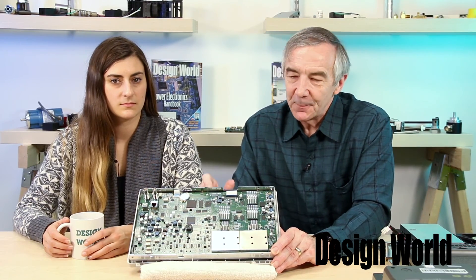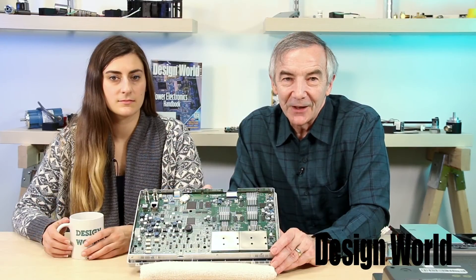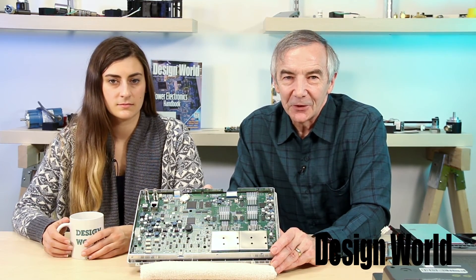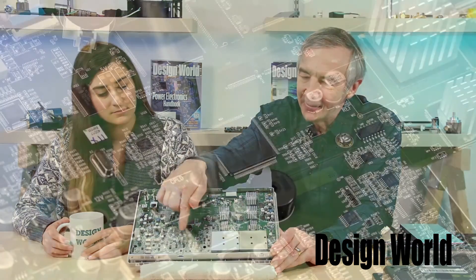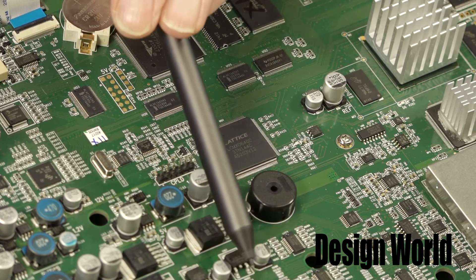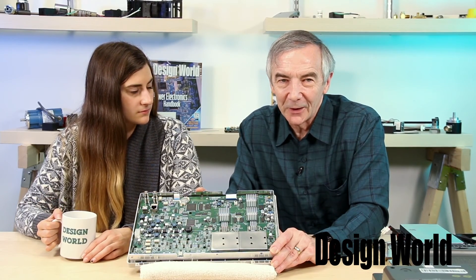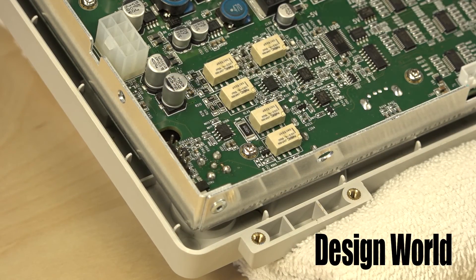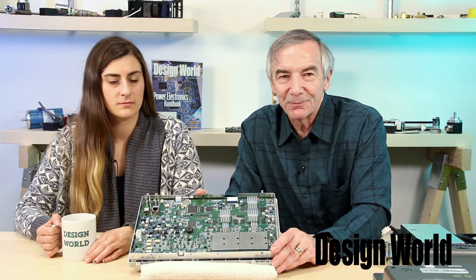That leaves one other large chip down here, which is a big logic block device from Lattice Semiconductor. That one's an FPGA kind of a chip, so we don't really know what goes on in it. But it sits between the Blackfin processor and the A to D section of the board and above seven chips, which are all the same kind of high speed comparator. So if I was to speculate about what it does, my best guess might be that the Lattice chip and the comparators might help define the functions synthesized by the function generator in this scope, which actually has an output over in this corner of the board. Comparators like these are often found in sample and hold circuits, which might come in handy when you're digitizing waveforms. But again, we're just speculating here.